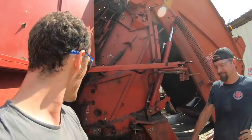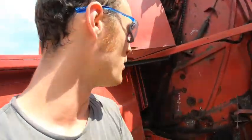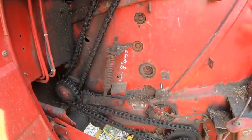We were dealing with the haybine yesterday and found out that the idler for the main drive belt was pretty much completely seized up. I never would have known about that. It looks like it's moving when it's running, but there's an overheating bearing in there that's probably about to weld itself solid — a pretty much guaranteed day-ending breakdown narrowly avoided. And now we're finding stuff like broken-off bolts in here.